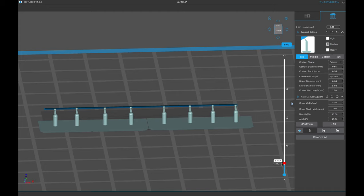The easiest way to fix this is to never have any straight edges parallel with your build plate. You just want some type of angle — and that's honestly it. Some people print right from the corner and there's nothing wrong with that. I'd bring the model back a little more so the face doesn't need any supports, and then I can support everything from the back plate with heavies, getting one as close to that corner as possible without cutting over to it.